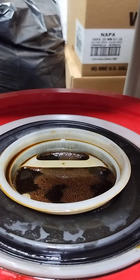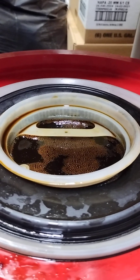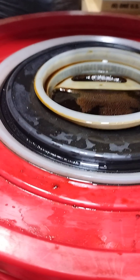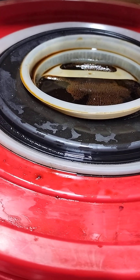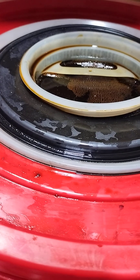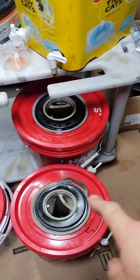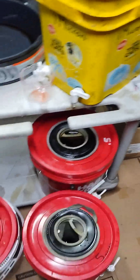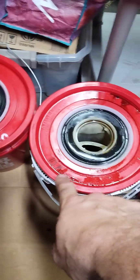It's a little time consuming, but it's a whole lot cheaper than buying a centrifuge and a whole setup just to get down to 5 microns or so. You could buy yourself a centrifuge to save the time and effort and then run it from 5 microns on through. I could add a 20 and 15 micron stage before the 10, but I haven't had any problems yet.